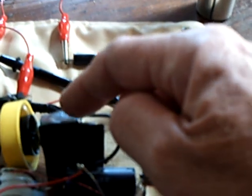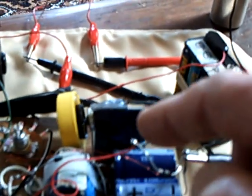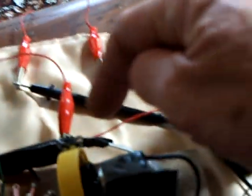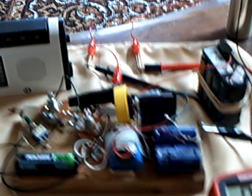You also run into problems on this kind of arrangement with the brush wearing, and of course the bearing wearing. This is not a very good motor bearing situation. But anyway, that was the little project I went back to — I call it Back to the Pulse Motor. There's the circuitry for it. It's just a standard pulse motor circuit using a reed switch — the reed switch is right there — and that drives the wheel. It's tied in with circuitry to run the permanent magnet motor, all to help out the pulse motor at night when the battery started going down. It kept the thing running, and I figured out I could capture some energy off the collapsing coil to help charge that battery. That was something I had a lot of fun doing.